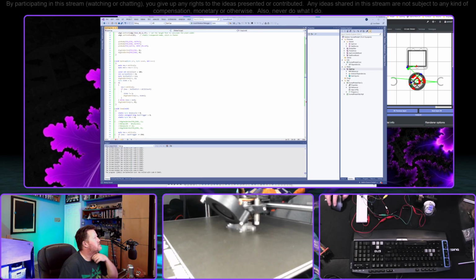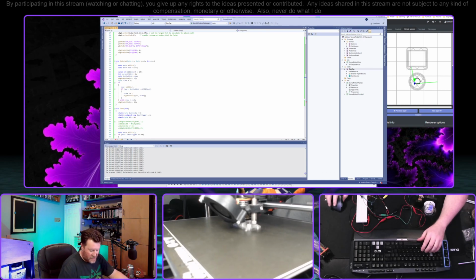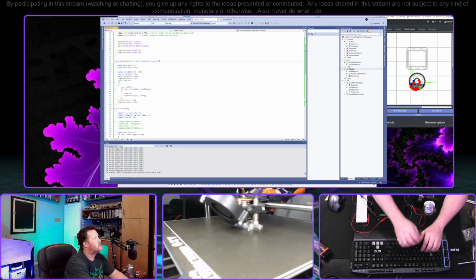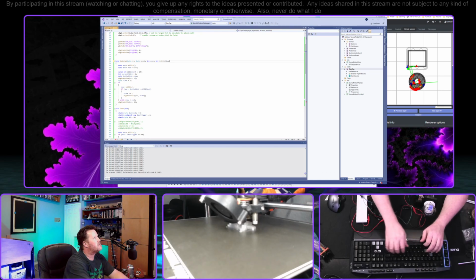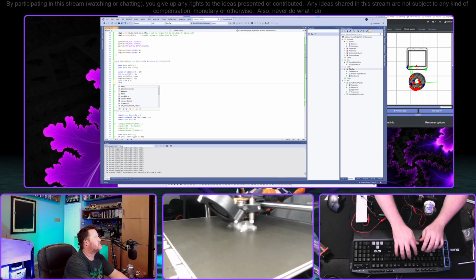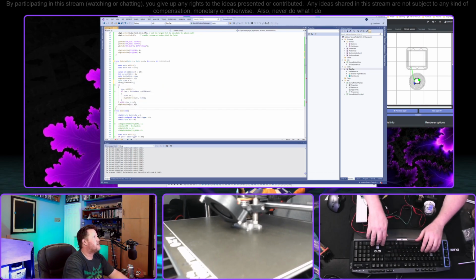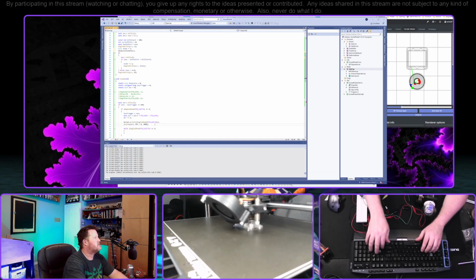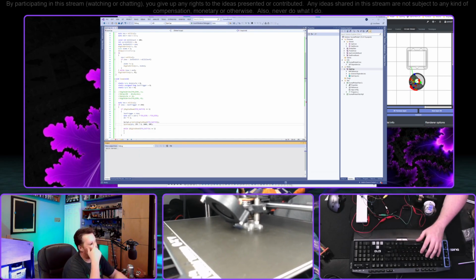I wonder if there's some actual startup torque that is necessary to move the motor in the first place. Again, I'm running this at 5 volts instead of 6, so there is going to be a little bit of a ramp up, I suppose. Let's do the initial millisecond pulse, if that helps us at all. So we'll do this for a full second, and the very first pulse will do 200.